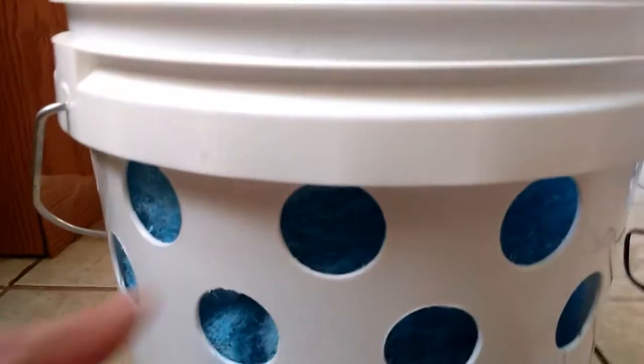The water gets saturated in this material — it's a humidifier mat that you can buy on Amazon; I'll put the links in the comments. And then you have this vinyl tubing, which you burn holes in, so you have these little holes. The water just trickles out in like a double loop on top here — you see that? And that keeps this thing saturated. It also makes a seal against the lid so that the air is pulled in through these holes in the side, and you drill enough holes to match the diameter of the hole on the output.